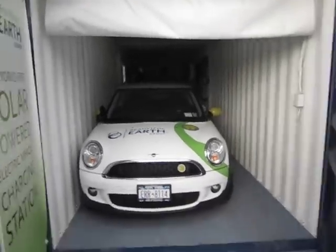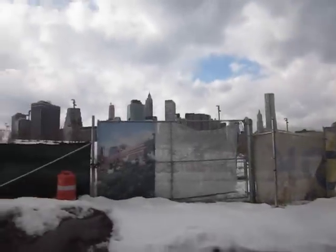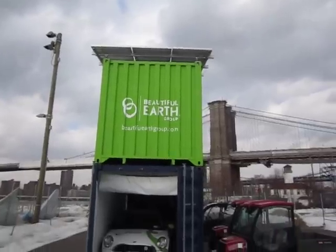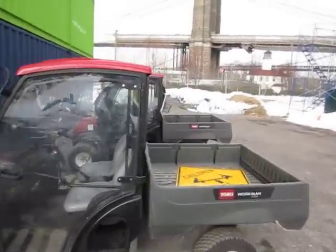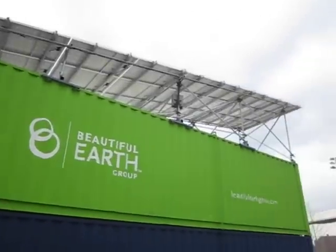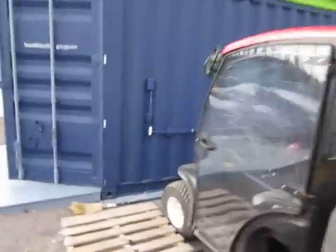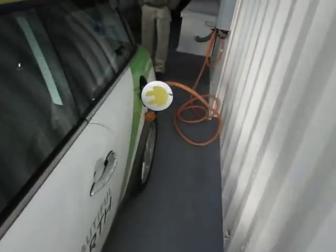This is it — a solar charging station in New York City. There's our lovely city. Here's the EV and the solar on top. Some smaller electric vehicles over here. It's a 5.2 kilowatt peak system sending its electricity to lead batteries inside, through a charge controller with maximum power point trackers. Beautiful Earth has had it for almost two years now — it'll be two years by summer.